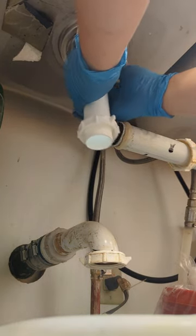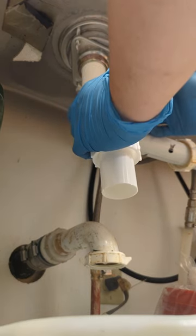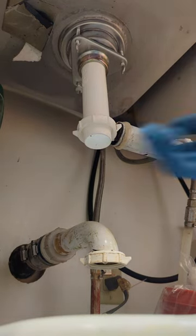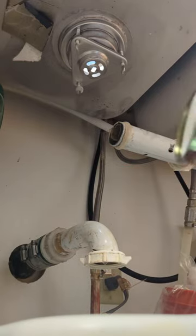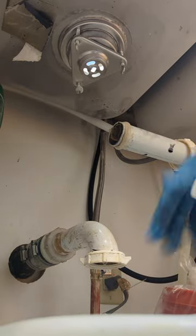Here's the new piece going on. Tighten it down a little bit, then get my measurements so I can make the cuts — gotta make sure it's the right length. This is the rigid PVC cutting tool I'm using. Love this thing — it makes the job super easy. It cuts and also reams at the same time.